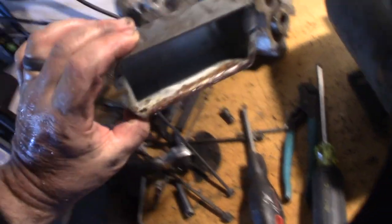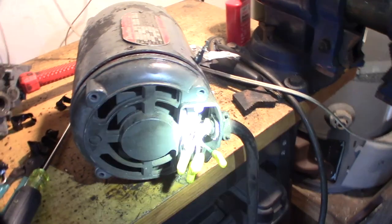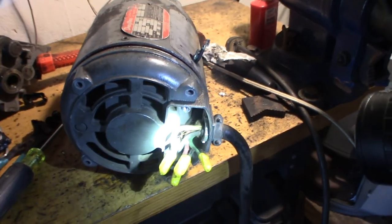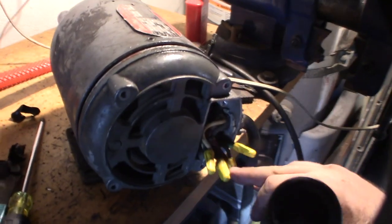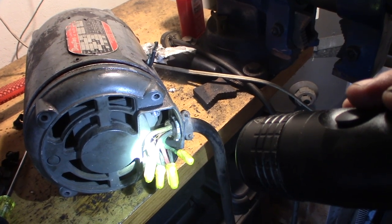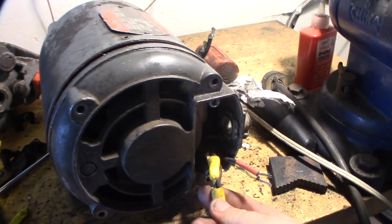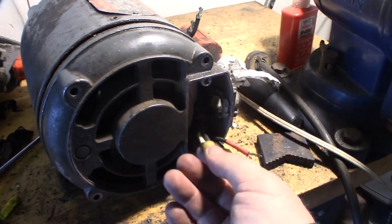I think this capacitor was leaking for a while — see all that white crust. The wiring is a little nuts; I'm thinking I might have to take the wiring apart to pull the cover off. Every single feeder wire is black. Looks like somebody put white tape on the neutral. I might have to label that on my own. There are two wires going to the hot phase. I marked the yellow — I know that's the ground. The red was connected to the red wire. The blacks that are bundled together I'm going to keep bundled. The white wire was already marked.